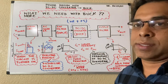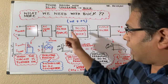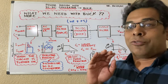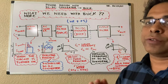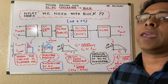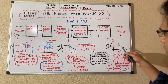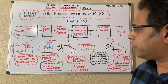The output filter covers just the high-frequency range, whereas the EMI filter requires coverage from low frequency to high frequency. It's good to have both, but you have to make sure you fulfill your requirement specification. Based on that you should design the output filter, but the EMI filter is usually a must in most cases. FC is the corner frequency for the output filter and FC prime is the corner frequency for the EMI filter — both are based on your requirement.